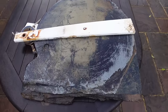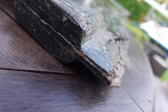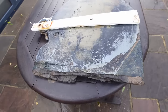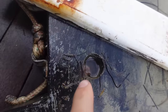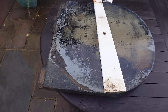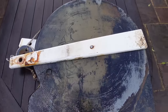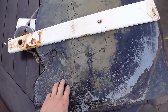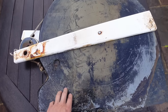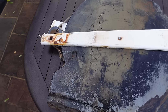It's the next day, and as you can see we've got the centreboard here, or what's left of it. You can see where it's broken off, we've got a little bit of the profile there. So that back end can be remade quite nicely. It looks like it's literally just wood that's been painted - no fibreglass at all, literally just wood. There are little cutouts so you can put the bolts in. I think making a new one would be relatively easy, but there's a guy down in Emsworth that I'm going to get to rebuild it because it's part of the price of the boat. I've got enough work to do, and I'd rather get this made properly because it's got to fit in that box and fit the boat nicely.